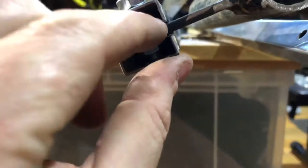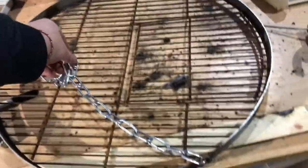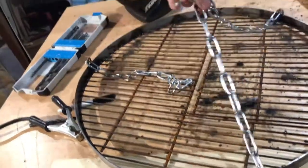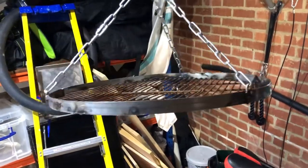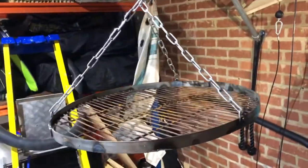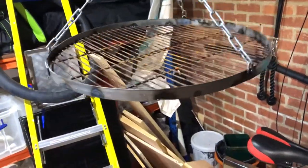I was getting a bit of wobble on the arms because it's pivoting, so I've put some bolts either side - you could use washers but I don't have any. This one's quite loose so what it allows you to do is just put your fingers in, turn it, and tighten it up. I've badly welded three chains on - they're only about a foot long and will hang above from one master chain. There's my swinging grill. I've prised apart some of the chain and put a little swivel in to let it rotate easily - it can take up to 20 kilograms, so maybe a couple of tomahawks, five kilograms maximum.